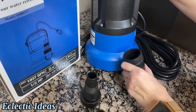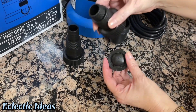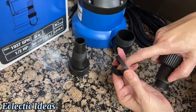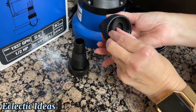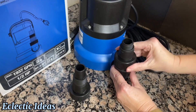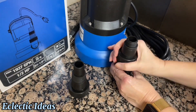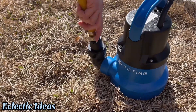We're twisting one end into the sump pump so it goes upright. There's a unidirectional three-quarter inch flow gasket — it goes one way so the water flows out just one direction. There's an arrow, so be sure it's pointing the right direction. The gasket is correctly seated here. Now we just screw it onto the elbow joint, and assembly is really that easy: one elbow joint, one hose adapter, and one unidirectional water flow valve. Our floating sump pump is ready to go for field testing.